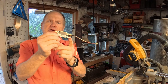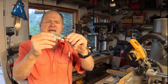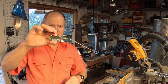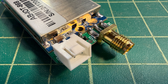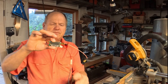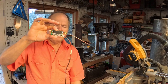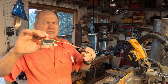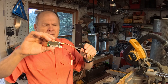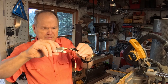The amplifier also requires power, and conveniently this amplifier is designed to work up to 6 volts. I run mine on 5 volts because that just makes it super easy. I've taken a USB cable, cut it, and connected red wire to red wire and black wire to black wire, giving 5 volts to my amplifier. When you go to do that, just double check it with a multimeter and make sure that red is the positive so that you don't damage the amplifier.